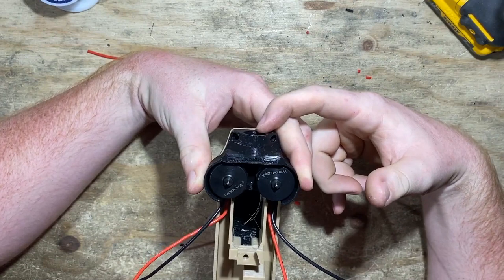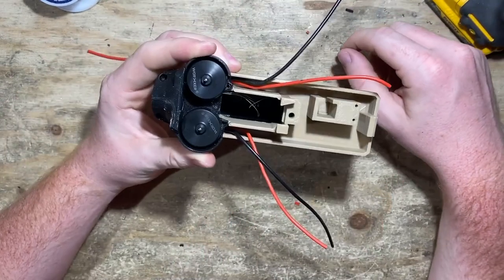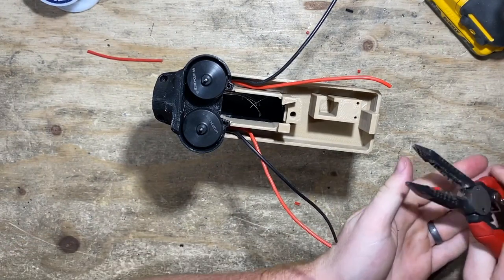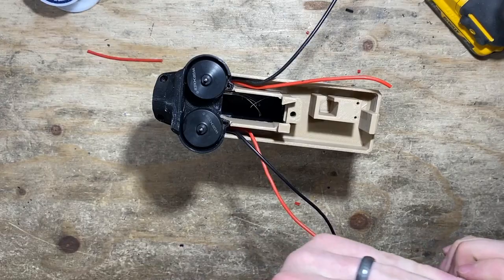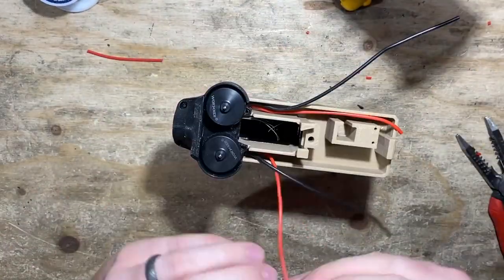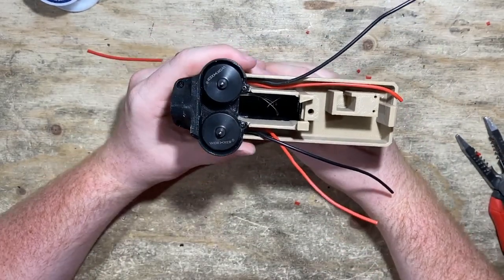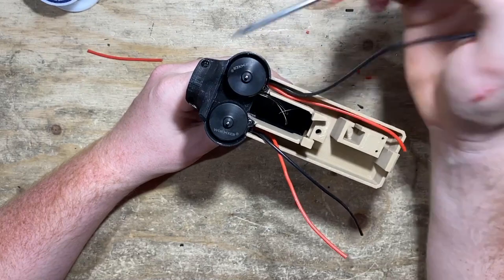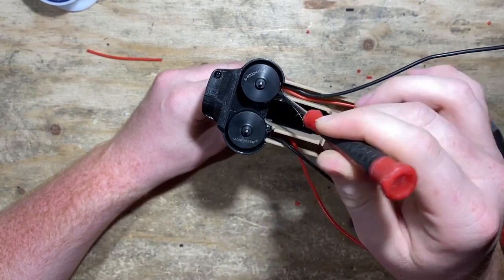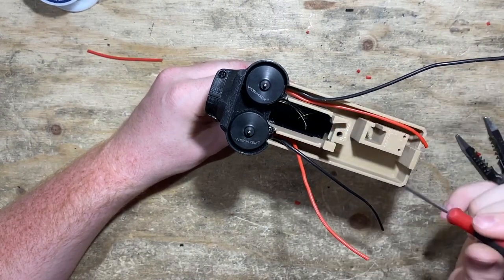With those two screws securing the handle to the lower piece, we feed the wires to the back — making sure the two-dot wire is on the right and the three-dot wire is on the left. Without pinching anything, we gently set the cage into place, and we should have a pair of wires on each side. Now we take four more shell screws to secure the cage in the two rear holes and two front holes. The front two holes need shorter shell screws, so I cut mine in half. There's a chance we'll modify the files so you won't need to do this.